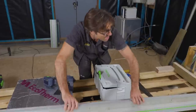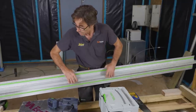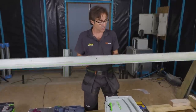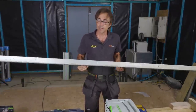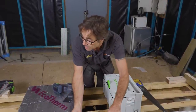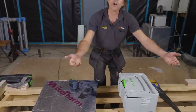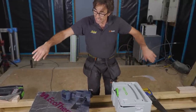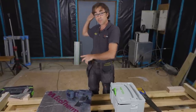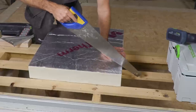All I've done is added a box section of aluminium — just a piece I picked up when we did some demolition — it's lovely and straight and it stiffens the rail up so it's not flopping up and down. In my table I've got two slots at either end that the rail sits in, relative to these blocks here. So when I slide my PIR in, that's exactly the run I'm doing. All the panels that go between the rafters are all exactly the same size. I used to use a saw — just doing one cut, look at the dust it generates.